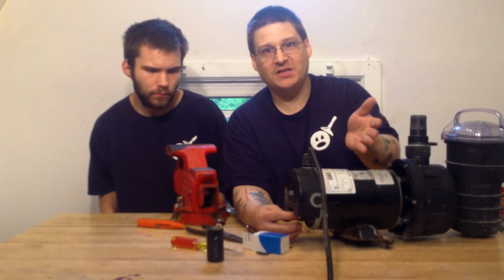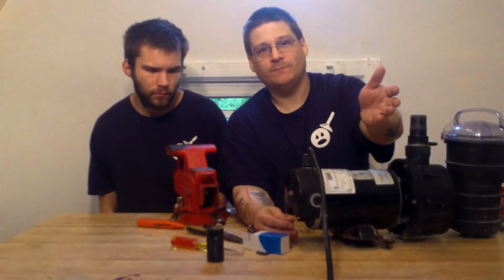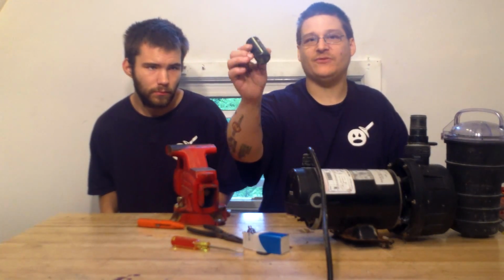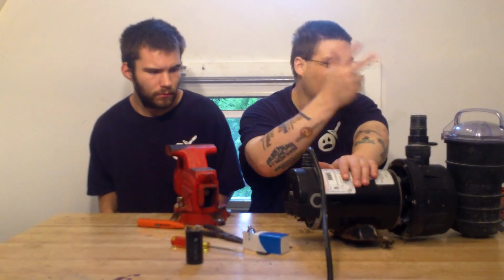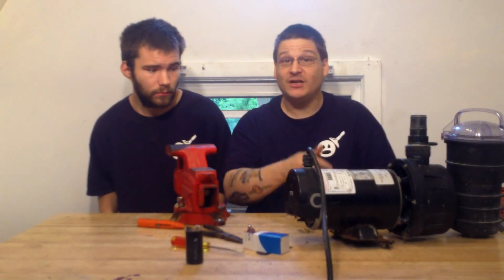Once again, we'll show you low speed, high speed. Alright, and a capacitor, they sell on the website for $10 plus shipping. So if you have a sand dollar pump and it's humming and your shaft is free and you're like, oh my god, I just realized that when I googled this pump it's $349 brand new and I can get a new capacitor, there you go.